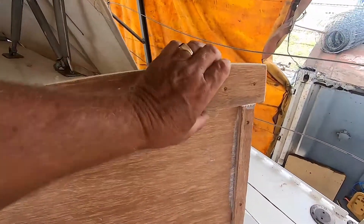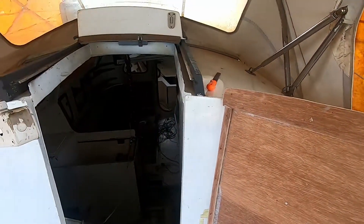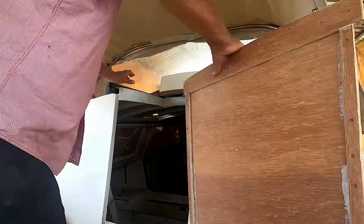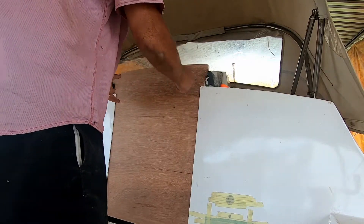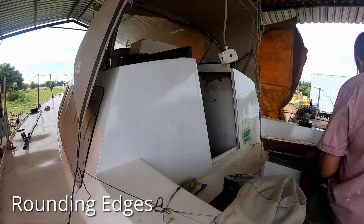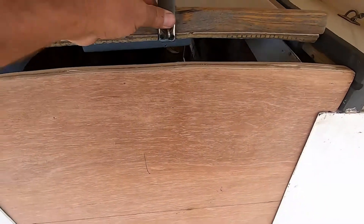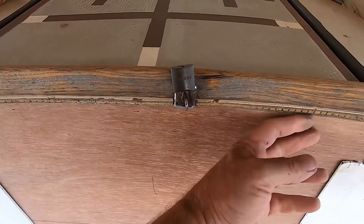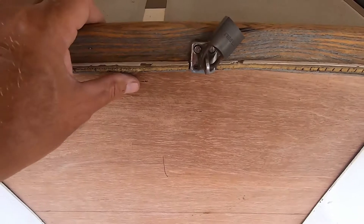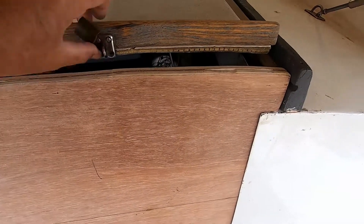We've cut that one out and put another piece of wood — a little lip on the side — just to make it broader. Now we're going to dry fit it and see how it fits. We'll probably have to modify it. It's a bit sticky so I'll have to sand around the edges so it fits nicely. It fits nicely now. This thing goes over, but I think the handle on the inside is catching there — it doesn't want to come out further. I'd like a bit more overhang here so we can stop water or anything coming through.